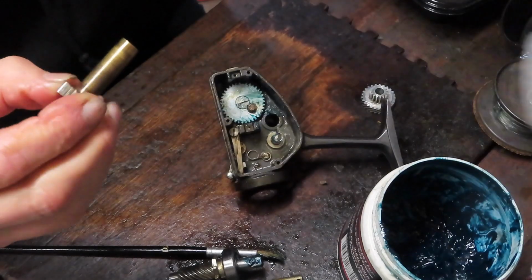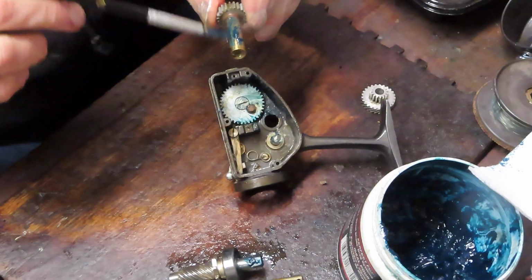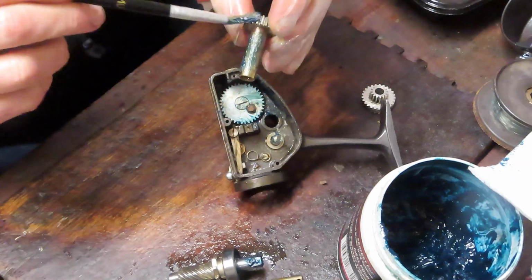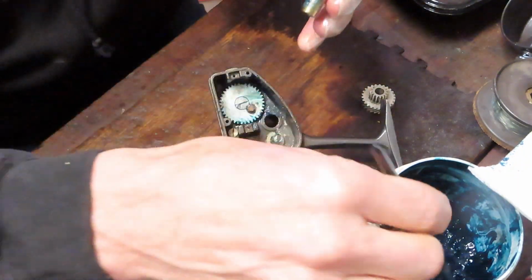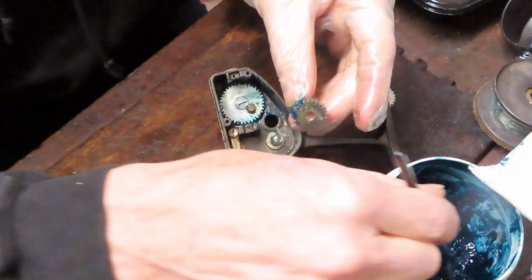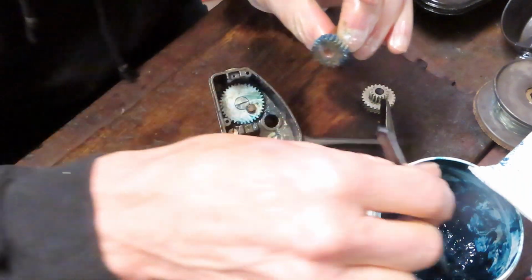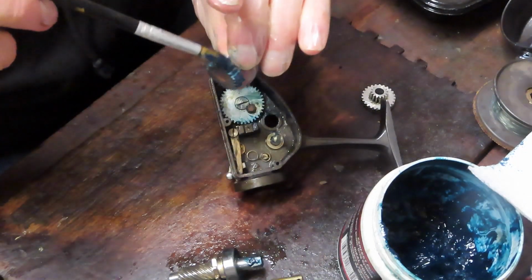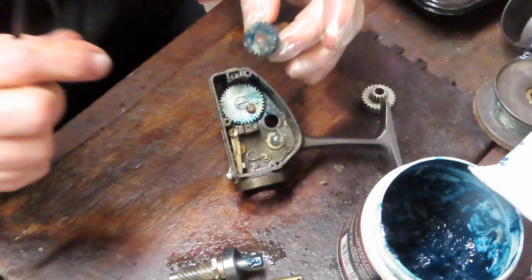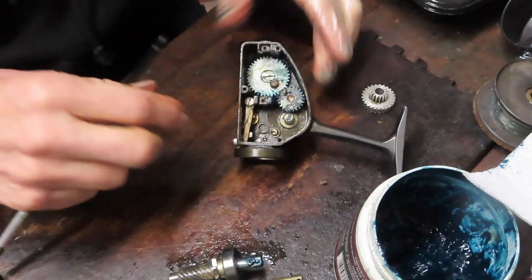We're going to just take that main gear now. We're going to wipe down the outside of it. Make sure that that's clean. Light greasing there, and grease into the gear slots that are going to interface with both the helical gear, I think I said it right that time, and the oscillation gear. This is going to drive both gears. I'm going to go ahead and put that back in.